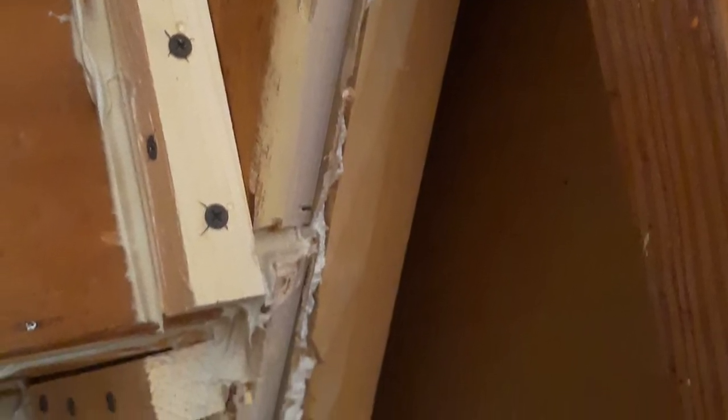There's a view looking into the kitchen with the missing sheetrock. That took care of the steps and risers moving. But the whole staircase was still moving. Look in the corner — that one-by-one piece of wood on the riser. I put one-by-ones on the steps and risers and attached them to the stringers — glued and screwed them to the stringers. The stairs still had movement and some squeak.